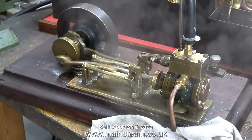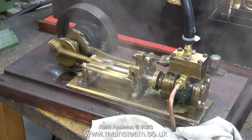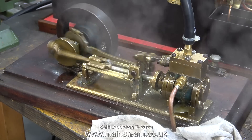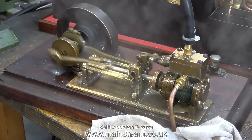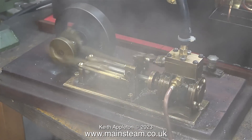I'm attempting to tighten the bolts that hold the steam chest cover and the steam chest in place, but unfortunately only two of them have got any thread left. The steam is getting out of hand — I'm going to pipe it away so that you can see what's happening on the screen.